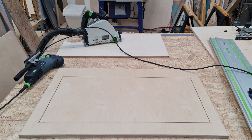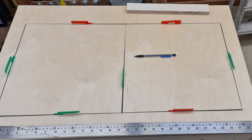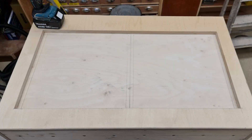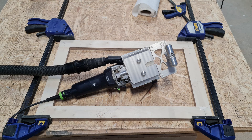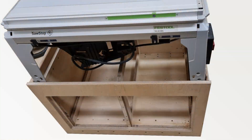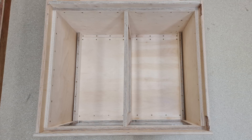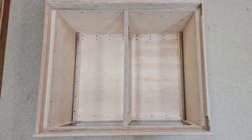Removing the left outer side, I cut a rectangle in it with my rail saw and jigsaw. I put it back with spacers to assess the aesthetics, was happy with the gaps, and marked a 12 millimetre perimeter on the inside skin. Not wanting to break into another 18 millimetre sheet, I made a frame as a divider using my Domino DF500 and fixed it in place with 4 by 70 millimetre screws. These extra-long screws are a handy fixing in the circumstance — quicker, more accurate, and neater than using my pocket hole jig.